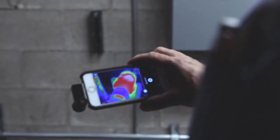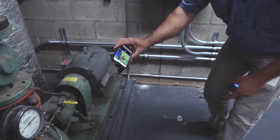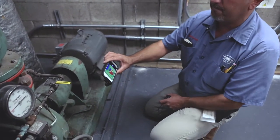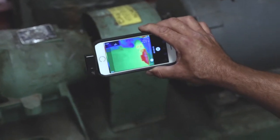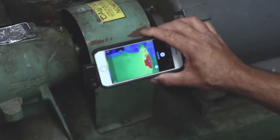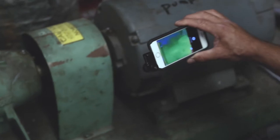I'm going to walk over by the motor. Here's your motor that's actually in use right now. Here's my pump bearing assembly — 102 degrees. And we have 113 degrees by the coupler. This will tell you if you have a misaligned coupler; if you have misalignment on your coupler, you'll have high readings on your temps here.